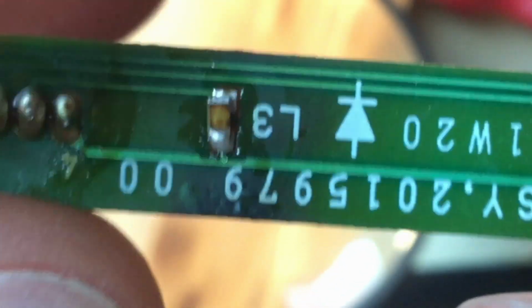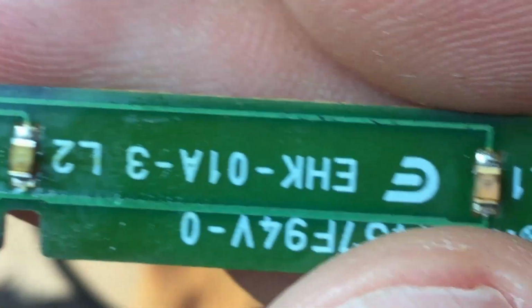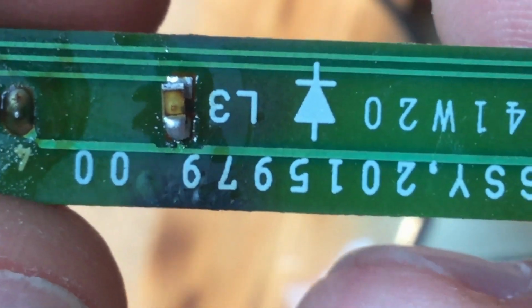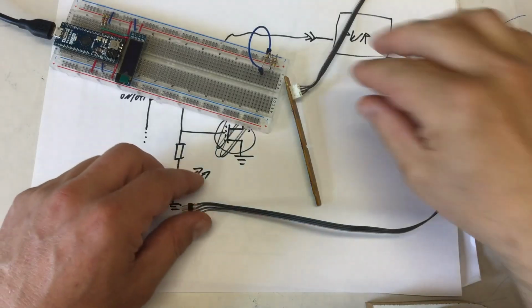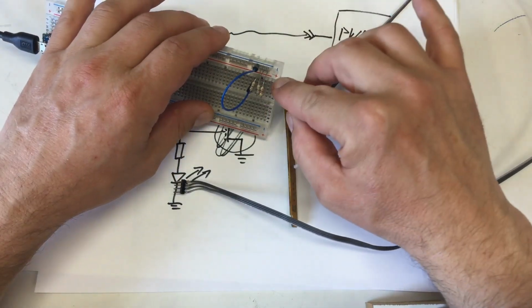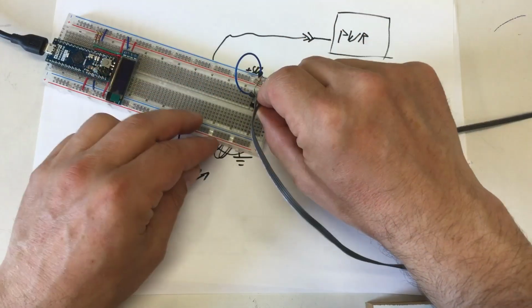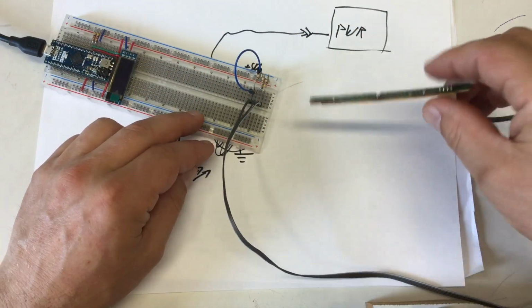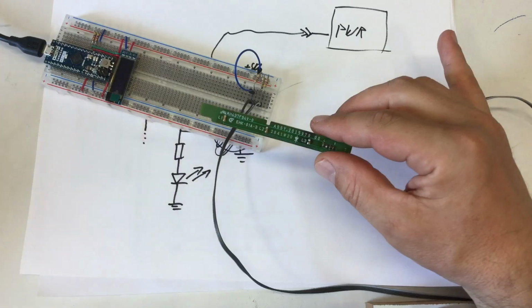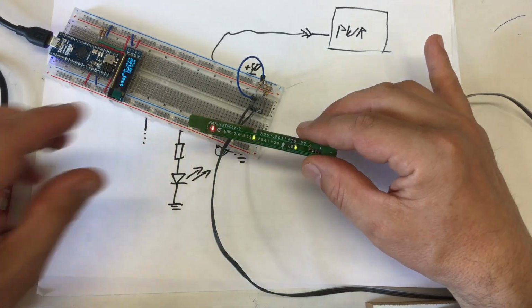And you see these little dots for the green. And for the red, they are on different sides. Okay, let's try that. So blue is ground negative again, and the resistors go to the positive rail, everything as it should be. I put this connector the right way in, and at least we expect the L1 red LED, error LED, still working. So, and all are still working.